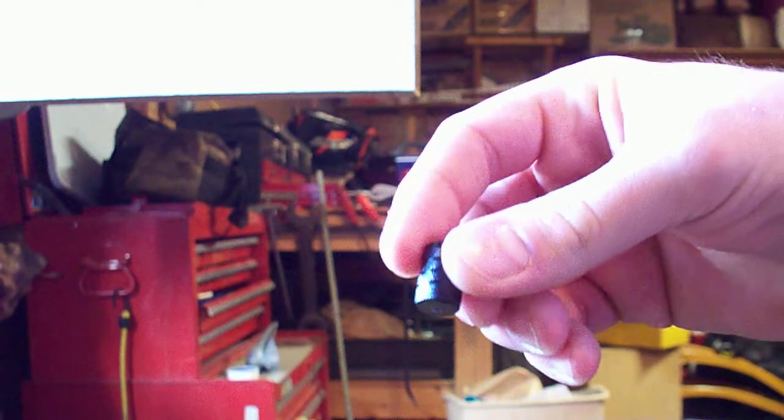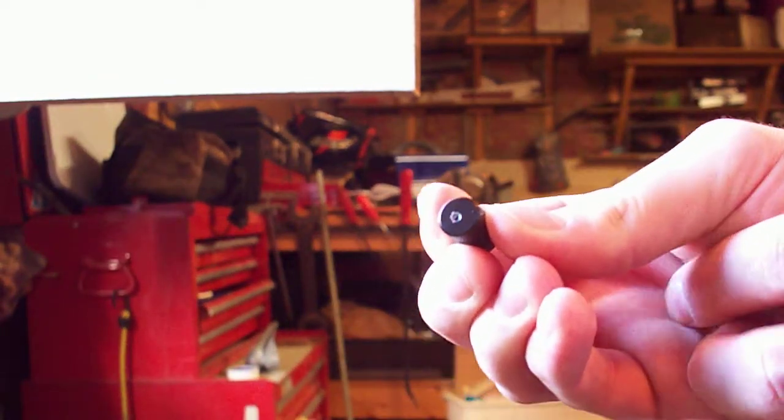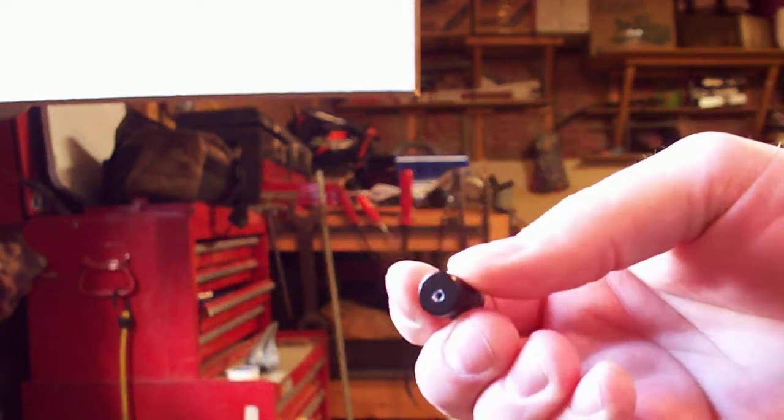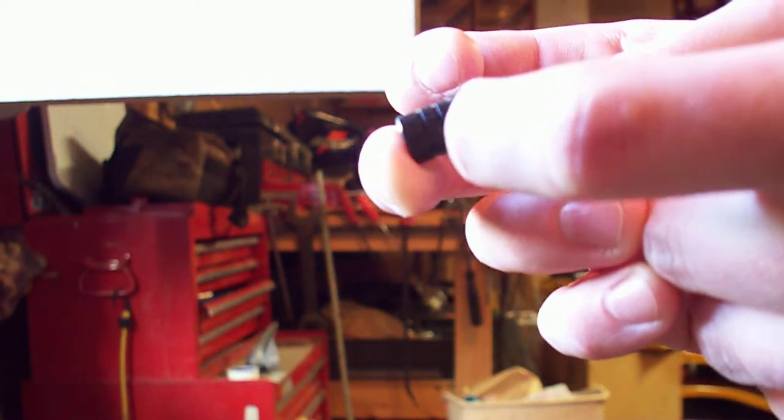The next thing I did was rough up this backside surface, the surface you drilled through the first time. The reasoning is so that the JB Weld has something a little better to adhere to. I just used the edge of a cutting disc on a Dremel tool to rough that up a bit. You can see on the side of this in the light the little lines, where it's not gnarled.